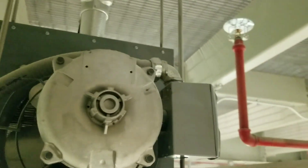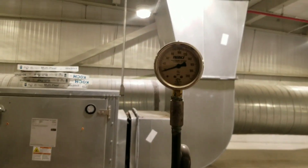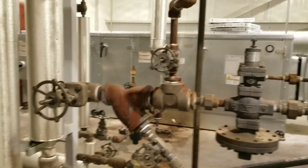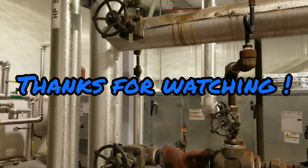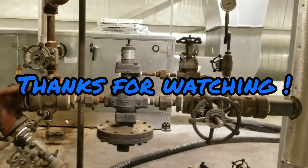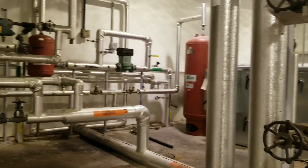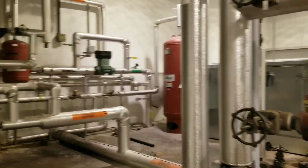Almost done with this building, only two more to go. Here we are guys — it's been a long day. We're running about 20 psi, less than half of what they told me they had to be running. We're going to call this one good. We're going to watch it for a little while. All our air vents are open, vacuum breakers installed on the ones that didn't have them, all our valves are open, and this system's operating just fine at 20 psi. We may lower it down a bit more, but we're going to let it operate like this for a while. If y'all like this, subscribe, leave me a comment, let me know what y'all think, and we'll see you guys on the next one.